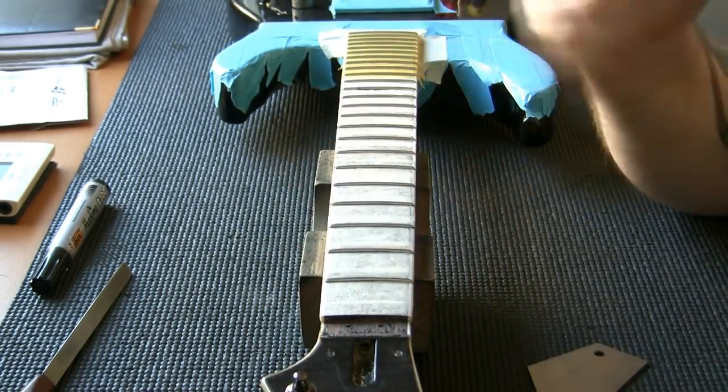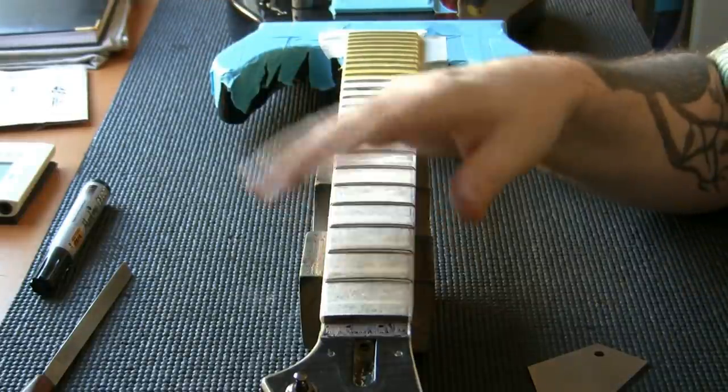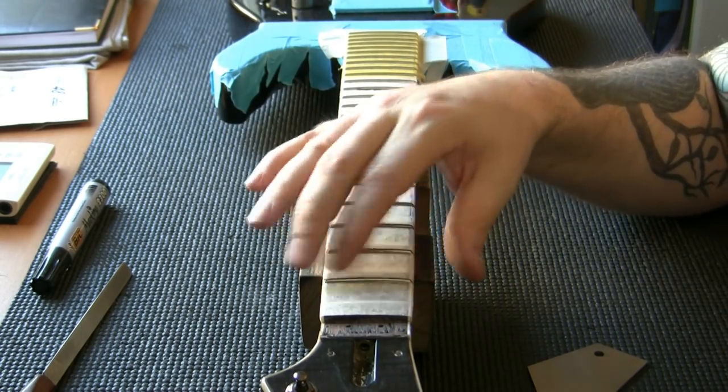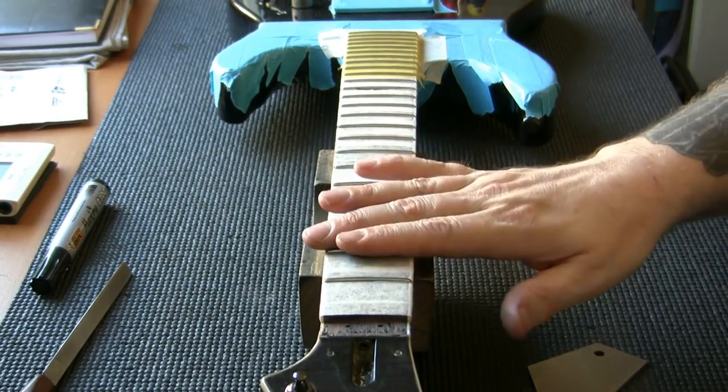If I don't get to show you any polishing on this video, I'll explain, as I just did with the different grits of paper. We'll go with five or six different grits of paper, starting at 800, finishing at the most 2500, which is an ultra fine grit. We'll bring these back to a lovely shine, get all the scratches out, and I'll finish off with steel wool.